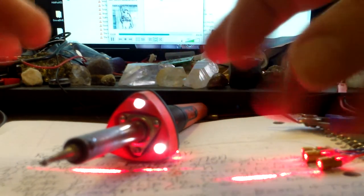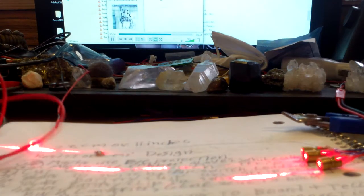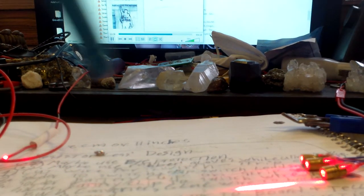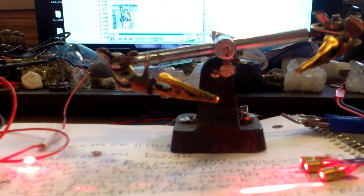I like my helping hands because leaving my soldering iron just laying there feels kind of dangerous — what if my cat walks up and smells it? So I don't like leaving the iron out. But if you solder that way, you may not need the helping hands to hold everything, because you're holding with two hands and the iron is just sitting there. You put a solder blob on the iron, touch your two tinned wires together to the blob, and the solder flows onto them easily.